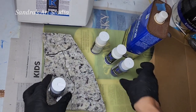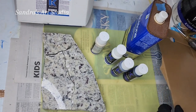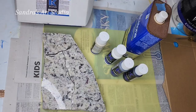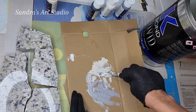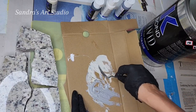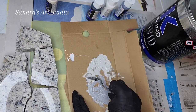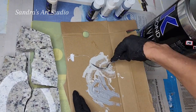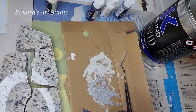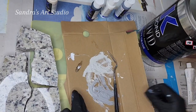I grab a piece of cardboard to do all my mixing. Once you put a blob of K-Bond on your cardboard, you strictly mix it with your colors — get the colors you want, split, divide, add, take, whatever you need to do. Just don't put the hardener in until you're absolutely happy with the color. Once you put the hardener, you only have about a minute to mix it well, and then four to six minutes to apply the product to your cracks. So it's not a lot of time.